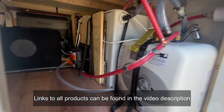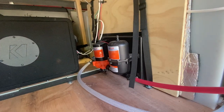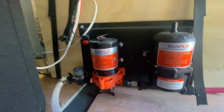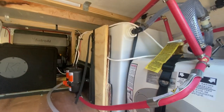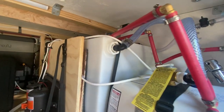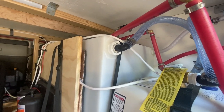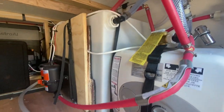Let me show you the whole setup now. In the back area we have a 12-volt water pump right there, the accumulator that comes automatically prefab on the board. It has just a simple negative and positive connection on the left-hand side that you just twist into place. That board is strapped to a 30-gallon fresh water tank, which is connected to a water heater. When it comes to plumbing, the connections are really not a simple subject, so let me do a quick analysis of the setup.